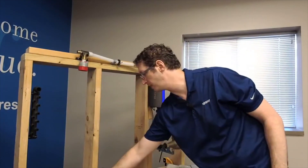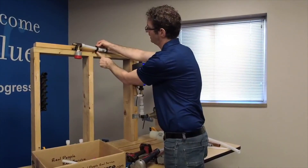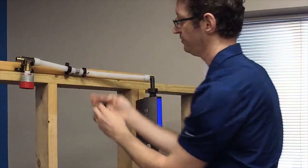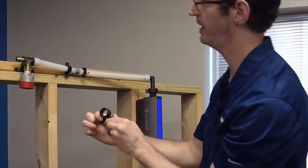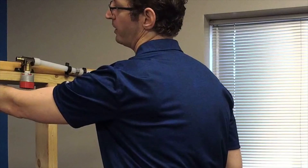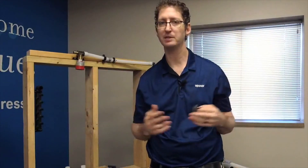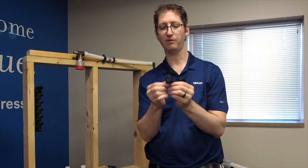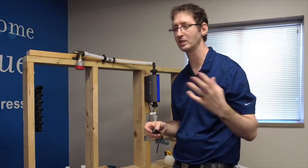We have other types of supports — what are called PEX clamps. This is a standoff clamp; it's got two holes in it and it hooks around the pipe with a little C shape. We also have suspension clamps. The standoff clamp is useful if I'm routing pipe over the top of a board or through holes I've drilled in the structure. It keeps the pipe off the structure, because all pipe expands and contracts. Copper lines can rub against the joists and make a clicking noise, especially on hot water lines. These clamps insulate the pipe from the structure so it doesn't make that clicking noise when the system is expanding and contracting.